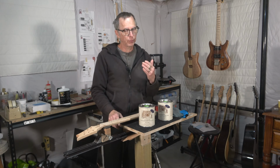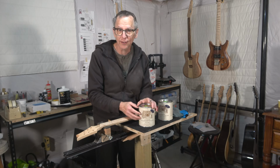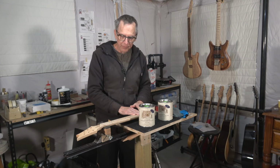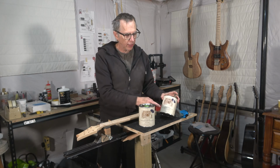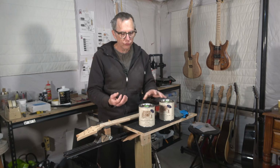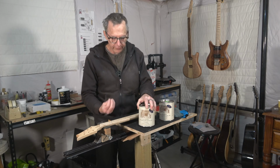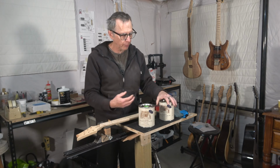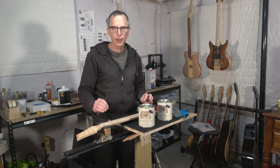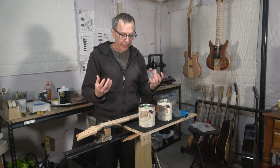However, as some of you are probably wondering right now, why not skip the high luster and use just the sealer? Well, the problem with that is the sealer can't offer the same build quality and high luster sheen that the high luster formulation offers. So ideally, we want to start out by applying the sealer to get that tung oil deep into the wood where it's going to seal and protect the wood. Then we want to follow up with the high luster because it's going to build much better and offer a higher luster and even in some cases a glossier sheen.